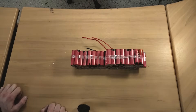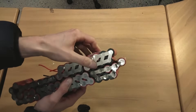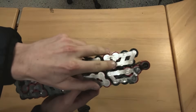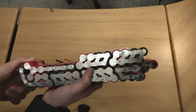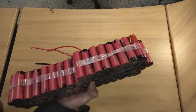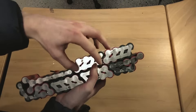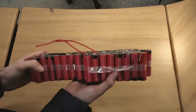This was filmed as an afterthought, but it's really important to mention that the series connections — the ones that carry the current between cell groups — there are only two nickel strips. Even though the batteries themselves are rated for 40 amps total continuous current, these nickel strips are probably only 10 amp rated each, which means that if you try to pull the full 40 amps you're going to get really, really hot, especially in these areas, and that will transfer to the battery cells and potentially cause damage. So you'll want to avoid drawing more than about 20 amps from a battery like this. You can upgrade by welding another nickel strip over the top of each one, which will give you that extra current capability — but this battery will not output 40 amps reliably.